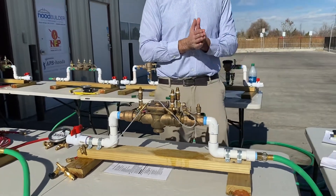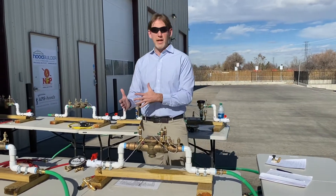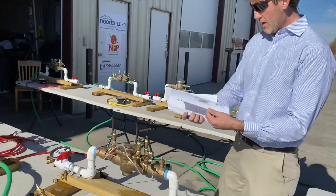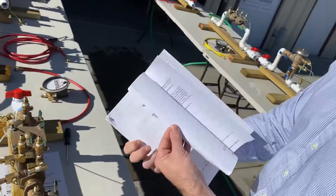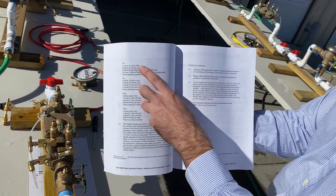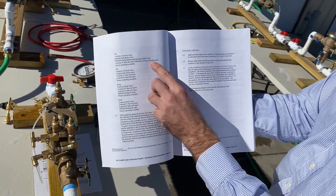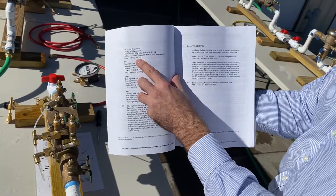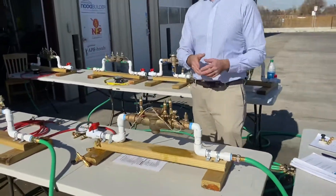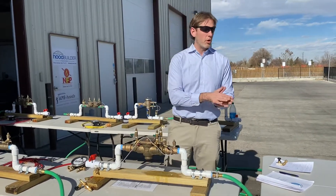The key thing to remember is not all of the diagnostics in the USC book are possible to encounter on an ABPA exam. We actually have the ABPA exam booklet here, page 313. It outlines exactly the possible outcomes you're gonna have on the RP: it's either gonna be leaky first, leaky second, malfunctioning differential pressure relief valve, leaky shutoff, direction of flow or back pressure, or a proper operating assembly. There are also further limitations because the test fitting setup that USC has published is not able to perform some of those failures.